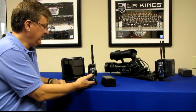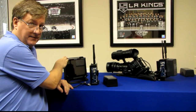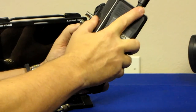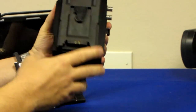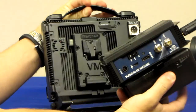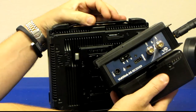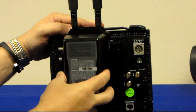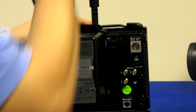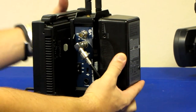Now we're going to take a VitoLink 5G receiver, a V-lock battery, and a small confidence monitor and show you how to connect everything together. First make sure the unit is off. We connect our V-lock battery to the male V-lock port. Then we take the VitoLink receiver and battery and connect it to our confidence monitor — everything has V-lock battery plates on it. We can do a similar setup with Anton Bauer battery plates. Then we take a cable from the video output of the receiver and connect it to the video input of the monitor, giving us a wireless battery-powered confidence monitor.